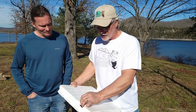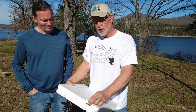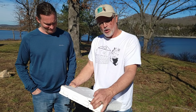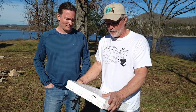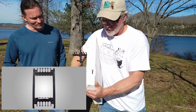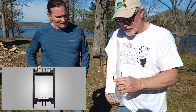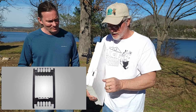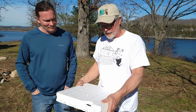The web is designed to hold a screw better than a 2x4 does. So if you can screw something into your 2x4 stud wall that will hold, it's going to hold just as good or better with this web. Now you want to make sure, because you can see here how thick the web is, not very, that the threads on the screw will actually still stay in the plastic and not sink all the way through, because then it's not going to hold anything. But if you sink it into the web, it'll hold just better than a 2x4 does.